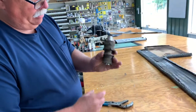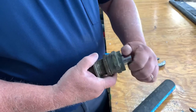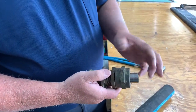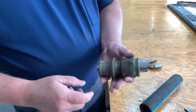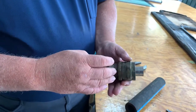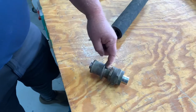This is the main part that we're concerned about. I actually have a piece of pipe in here and it's pretty tight — I've really clamped the packing down on this piece of pipe, simulating the shaft, clamped down pretty tight. So what I can see is that I have a whole bunch of adjustment threads left. When I look at this I can know that I have a lot of adjustment left, so if I'm leaking out of here I wouldn't worry about repacking.